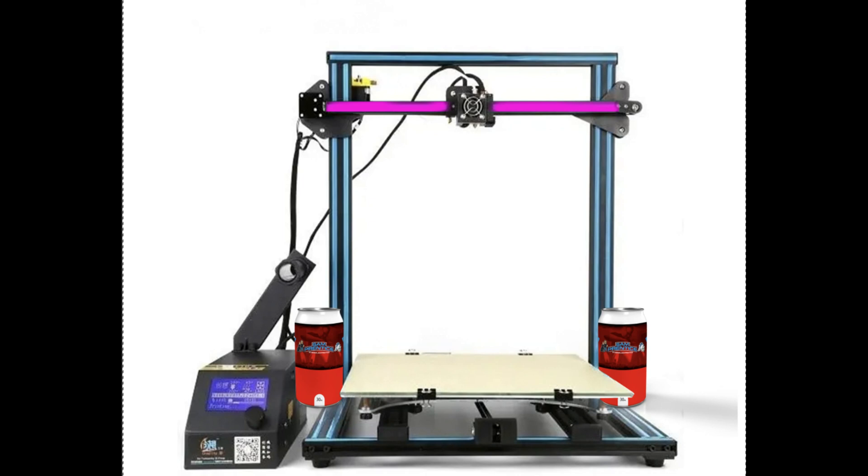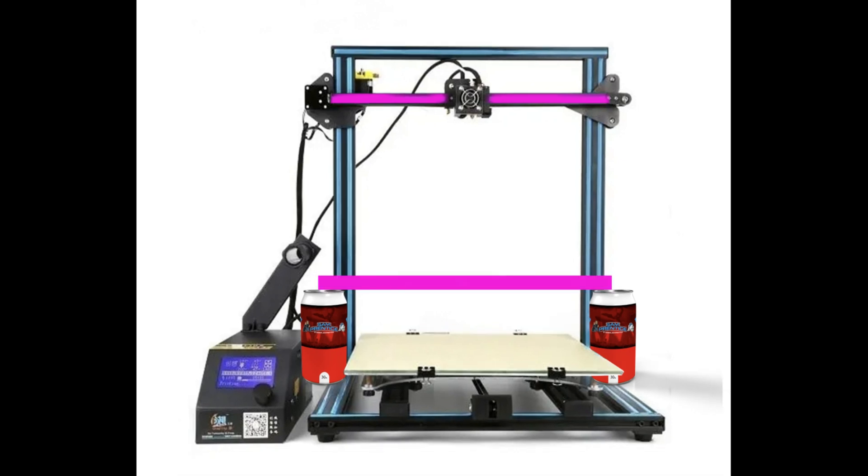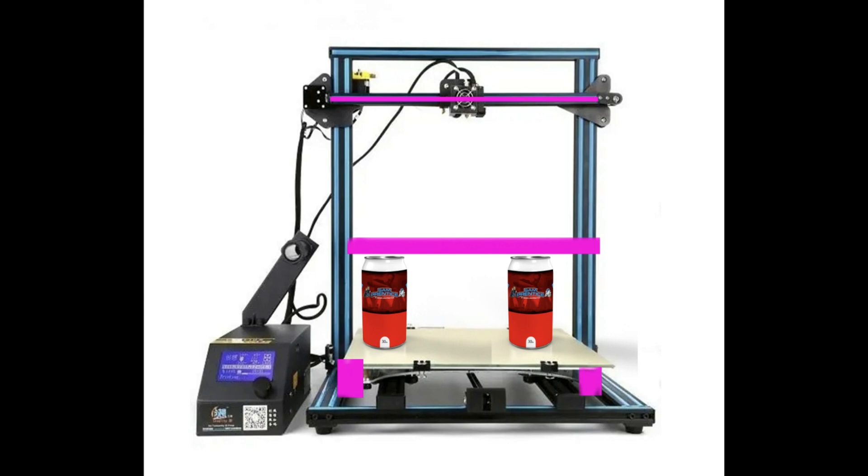There is a simple way to do this. I drop both sides of the Z axis down so that it's levelled with the special cans of Sam Prentice's Fizzy Pop. I manually turn the Z lead screws down to where both left and right of the bar is levelled. This should mean that both Z axes are levelled to the frame. Next, I use the control box to lift up the Z so I can fit the cans underneath the bar and onto the bed. Slowly lower the Z down so it's levelled to the cans — it doesn't have to touch. Move the bed and cans to the back, the middle, and the front, and if the plate springs, bed glass, and bed are all levelled, we can move on.